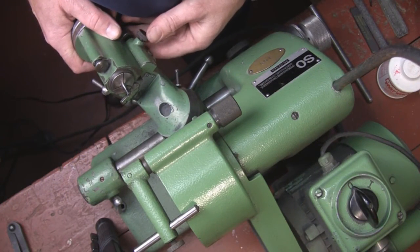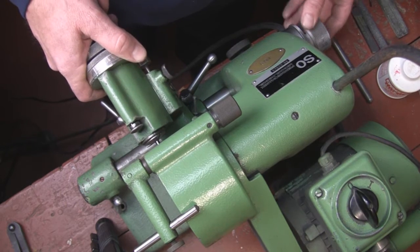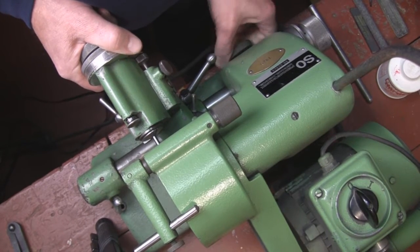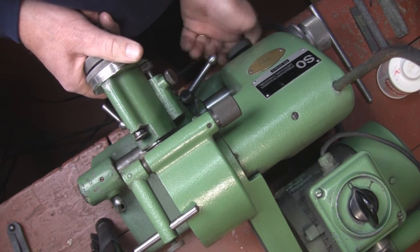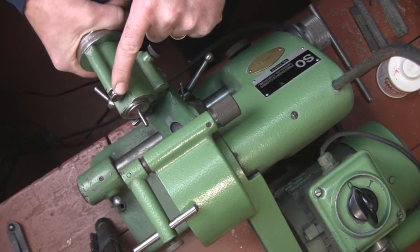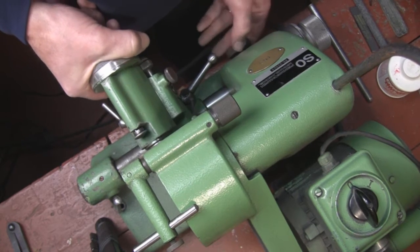In this video I'm going to show you how to start splitting a cutter. We're going to use this knob on the left which, as I turn it clockwise, is going to push the cutter into the wheel. The second knob we're going to use is this one down here. What this knob does is control how far in this cutter will go — screw it in and it's backing it off — so this controls the length of the slit on the cutter. We're going to go for about a half inch into the wheel. Recap: cutter is tight, it's indexed so it can't turn. We'll use this knob to move the cutter blank back and forth into the wheel, and this knob controls how far in it goes.